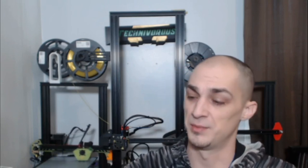That blaster was all printed in Kodak PLA, printed in a single piece in an orientation where the hilt is on the bed. It will print on any 230x230 by 250 build surface. This is actually a 75% scale of the actual model I made — I made it slightly large because you don't lose resolution when scaling down, so that allowed me to get more of the finer details in there when scaling down in Cura without losing round curves or going low-poly. Very happy with that, and very happy overall with all of the Kodak stuff I have printed.